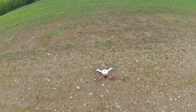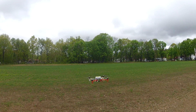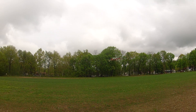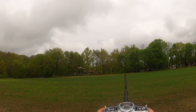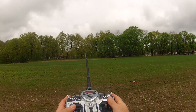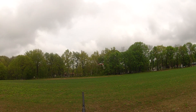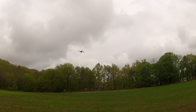I've got my dual rates on on this. Now right there — that's self-leveling off. What I notice about this firmware is before, if I pushed this much stick it wouldn't do that — it's very connected now. Before it would kind of drift if I pushed that much stick. Now if I push a little stick it actually moves a little. It's almost like flying with self-leveling on. But this is self-leveling on — look how much more I have to push the stick to make it move. I'm going to turn it back off and get back into acro mode.